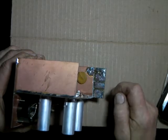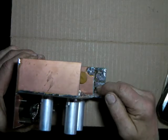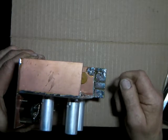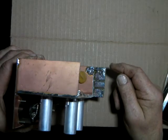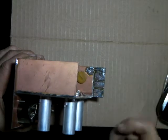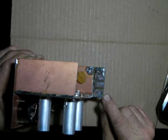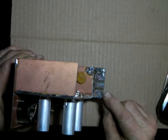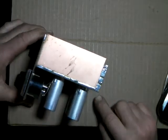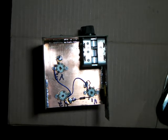So if you had a terminal strip, you could just bolt the terminal strip down or solder it, and where the lug goes to ground, that would be ground. And then all you need is 2 other ports on that terminal strip to mount the coil, however your coil is designed. Some coils, if you buy them as a normal coil form or like J.W. Miller, you can drill a hole in the chassis and they've got a little ring nut and a lock washer that'll fasten them down and bolt them to the chassis. But ours, the one I'm going to use, I could mount a hole. It's got a press fit type thing, but I'm going to need to change it as I go through different frequency ranges that I want to use, so I'm just going to mount it on the back. So the high end, where that goes. From pin 1 to the high end. And let's see, that was a 100 puff cap.